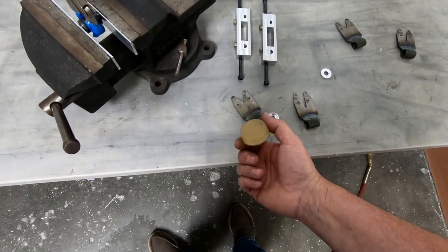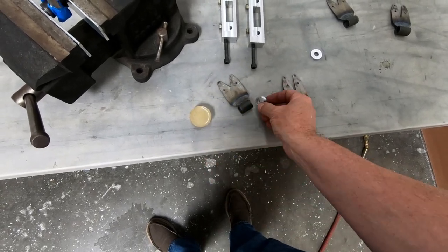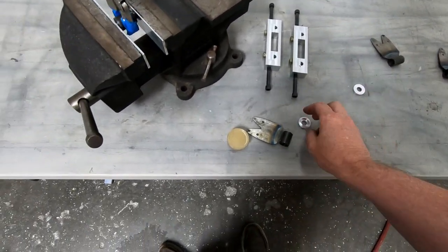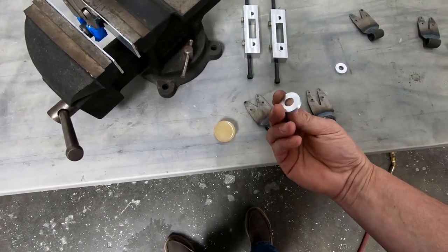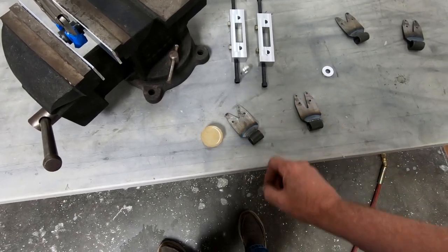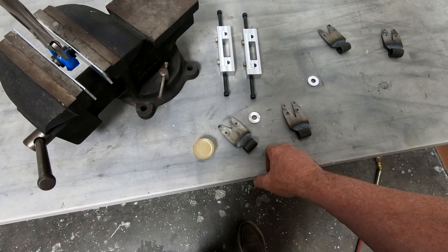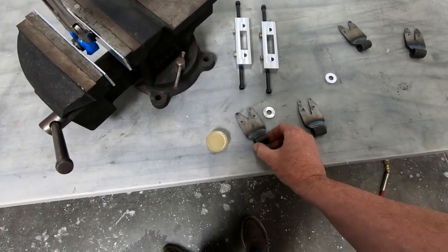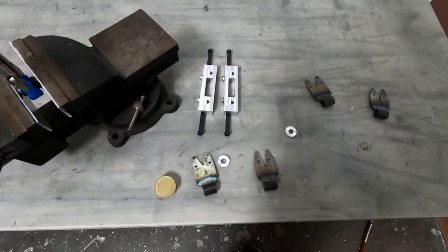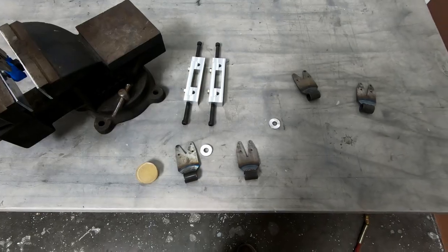Now the great thing is I know this stuff hardens within a couple of hours, so I'm just gonna use one set of these. I'll pour one, wait a couple hours, then mix another one and pour it. I'll do these a couple hours apart and they'll be done. I don't have to wait 7 days for this stuff to dry before I can reuse my little covers that go on there to hold the bushings into place, which is good. So I'm gonna start working on some of this. I'll start making these bushings, and I'll start final shaping these brackets here. But we're getting pretty close to being able to start test fitting some of this onto the airplane.